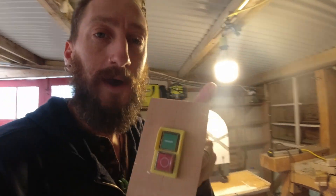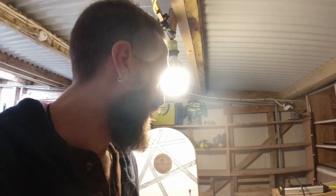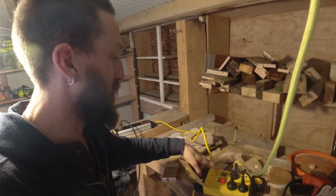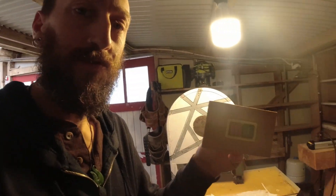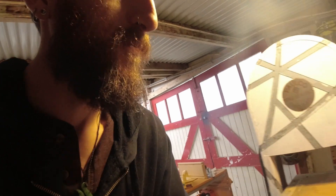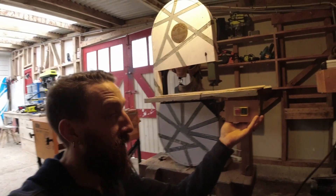The way these work is if the power gets cut off at all, it'll make the machine cut off. Currently, if I turn this off, it would turn everything off. But maybe I kept this switch on and just turned off the main power here. And then as soon as I would turn this on again, the saw would come on — so that's not very safe. What this will do is make sure that any time the electricity is cut, the saw won't just power on again once the power comes back on. So it's a safety measure, but there's a certain convenience for it too, of just having a normal power switch installed on my bandsaw.